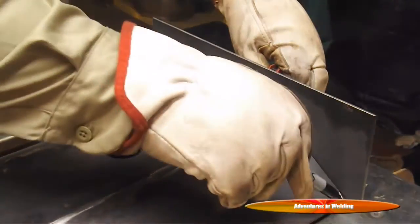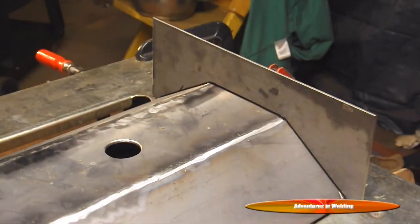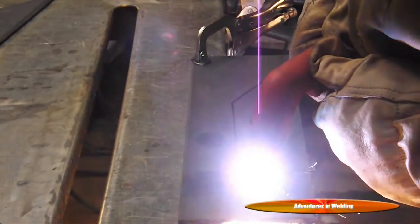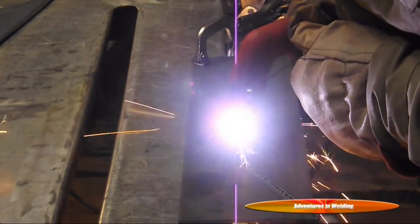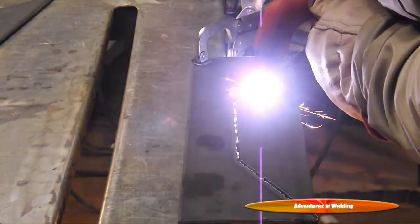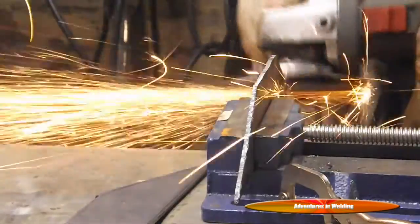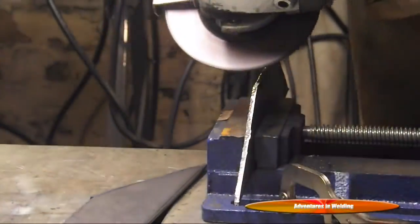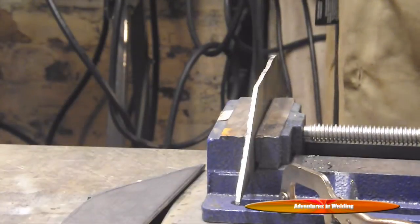Now that's pretty. Pay attention — this is my technique for getting a nice match-up on the sides: we just trace it. My freehand plasma cutting technique leaves a little bit to be desired, but that's okay because I trace from the outside. My rough cut really doesn't matter because we're going to hit it with the grinder and take it down maybe a sixteenth of an inch or so, so that we have a nice edge to weld to. No biggie there.